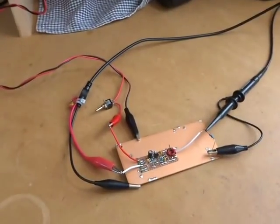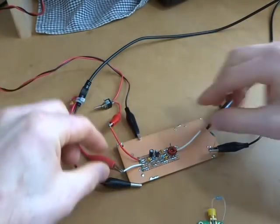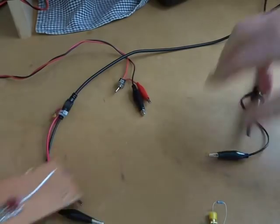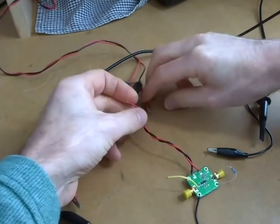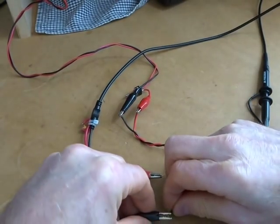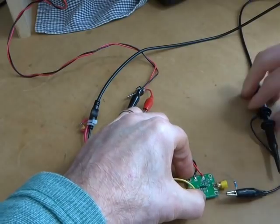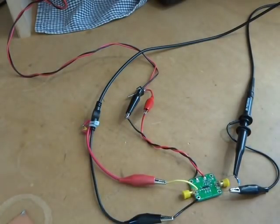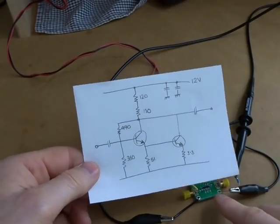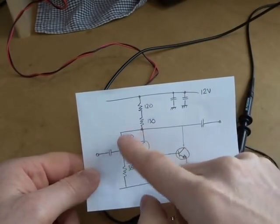So that's the J310 amp. Now I want to very quickly change to the second amplifier. I'll drop the voltage down to 12 volts as it's a 12-volt amplifier. So this one came from AliExpress — about 12 New Zealand dollars. Getting a magnifying glass out to look at those surface-mounted devices, this seems to be the circuit: a common emitter biasing on the first transistor.